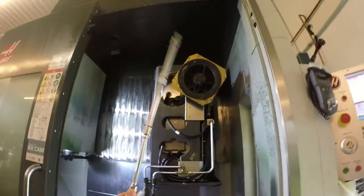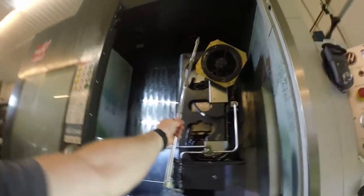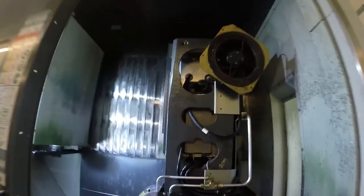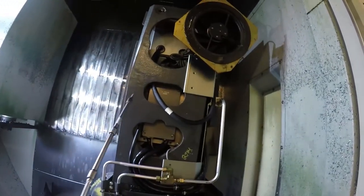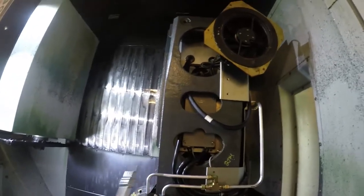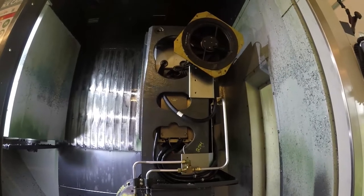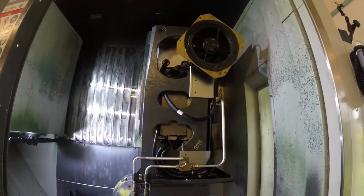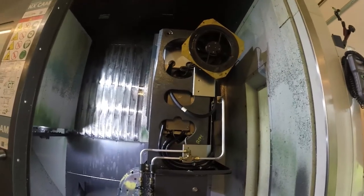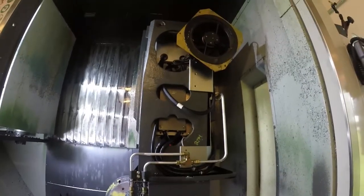So we have our extension — like 30 inches of extension — and that's going to go up in there. We're going to come down right around here and there'll be bolts. Not very easy to do or see, but we'll loosen each one about one full turn, and that's enough. Then we'll start working on the bottom of the spindle.